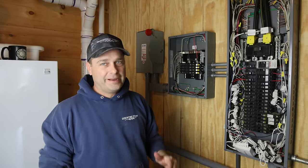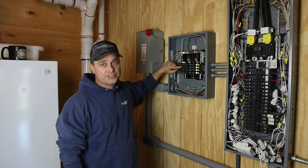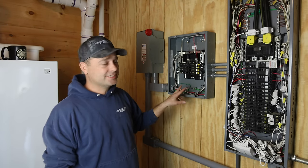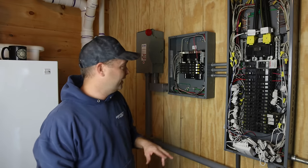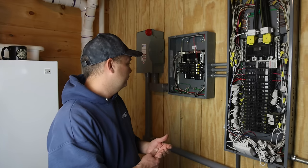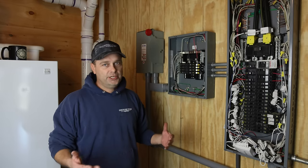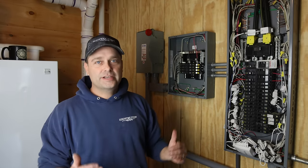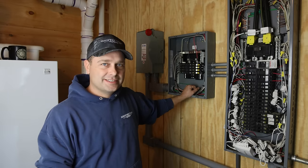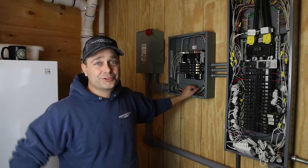I've been monitoring our power usage for the last six weeks or so, so I know exactly how much power each one of these circuits uses. When I put them in here, I tried to put them in balanced. The way this breaker panel is laid out, the first row is phase one, the second row is phase two, and it just alternates down the panel. Phase one should be running about two kilowatt-hours a day, and phase two should be running about two kilowatt-hours a day. Since I'm using the EcoFlow Delta Pros right now, it's going to help guarantee those get drained at basically the same speed. I'm using about 65% of the battery a day, and hopefully it will recharge every day.